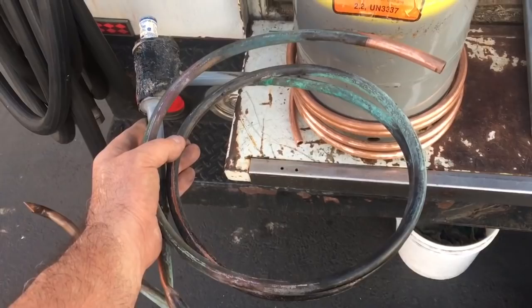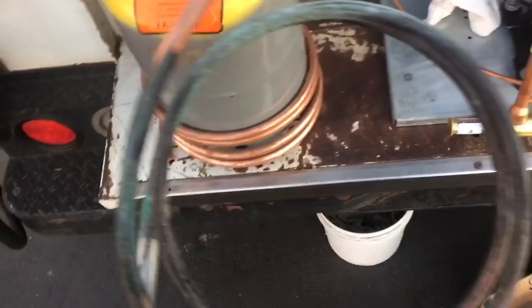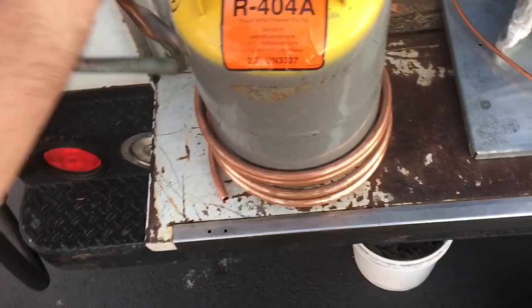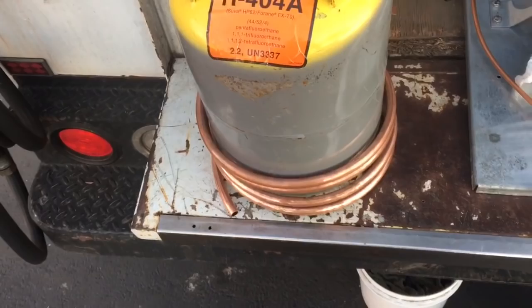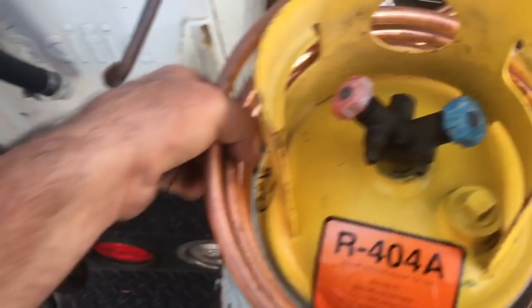Okay, world, how do you make this loop when you're trying to make these service loops for freezers and reach-ins when you got to pull these units out? A good way to make the loop is to measure across the loop and find either a CO2 tank or a recovery bottle or nitrogen or whatever. This recovery bottle fits this loop pretty much right on the money. So all you do is wrap it around the tank and start pulling, and you get her wrapped around, and she didn't kink. Just wanted to show you guys that's how you do it. The tank worked really good, and that came out really well. All right, thanks for watching.